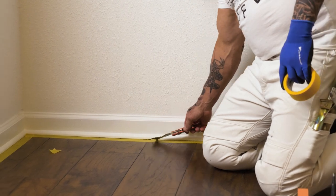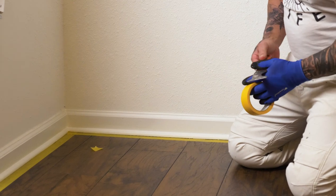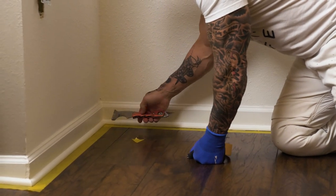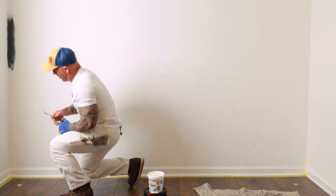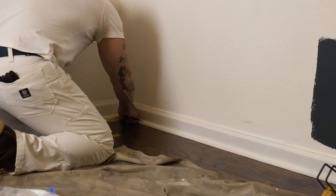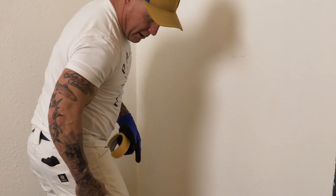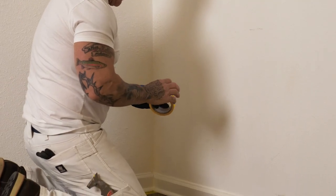I like running it on the rounded or beveled edge of my two-edged knife, just tucking it down. You don't want it touching the white, because if you peel off this tape and it's touching the white anywhere, you're going to see the white — because this color is really dark. You'll just see whatever you've got on the white when you pull that tape off. So make sure no white is exposed. Make sure your knife is nice and sharp when you're trimming your tape — if your knife is dull at all, it'll be really hard to trim your tape in nice 90-degree corners.